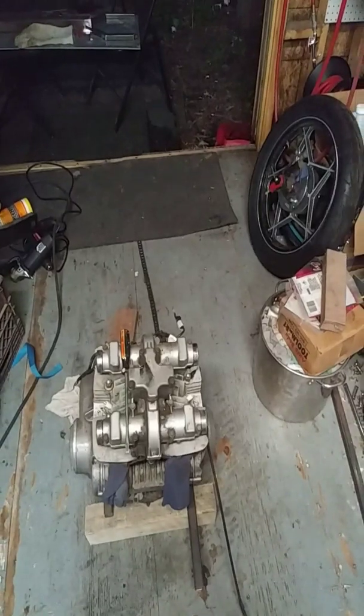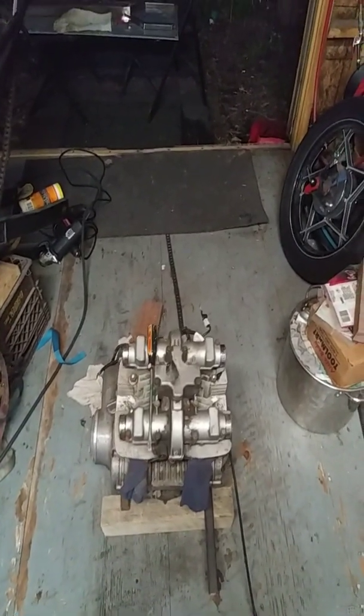And I do apologize for showing you all the same old views. I turned the camera on myself, but there's really no point in that. But this is my little impromptu weld table. I didn't do any welding tonight because I spent so much time cutting pieces and truing them up. And you know, when you freehand a 45 cut, it's 9 times out of 10 it's not true. So I spent a lot of time with a 45 angle and an angle grinder truing these cuts up, and I hope you can see they're pretty good at this point.